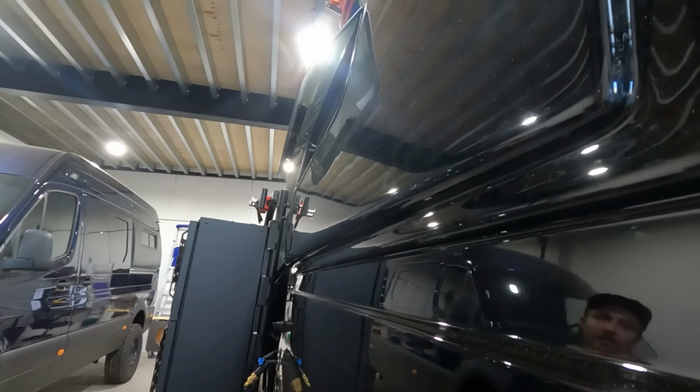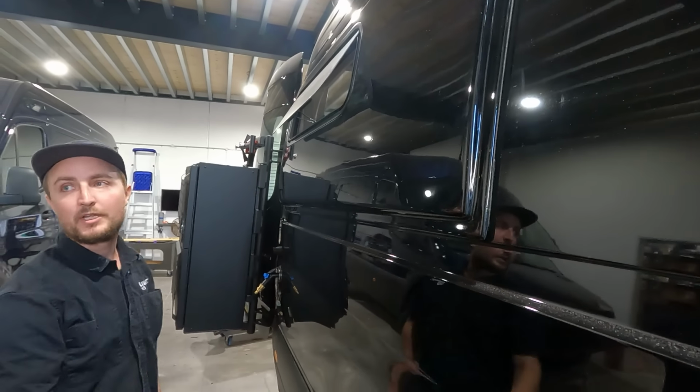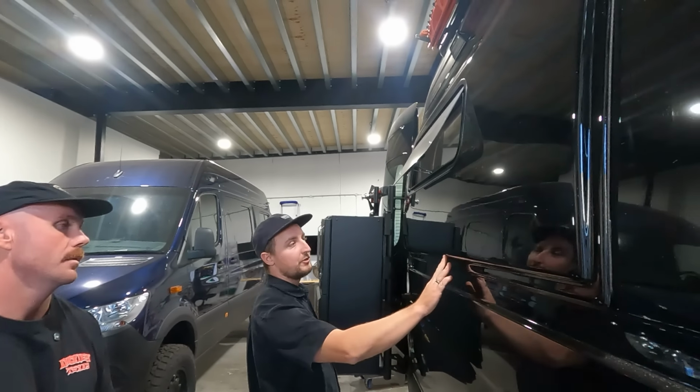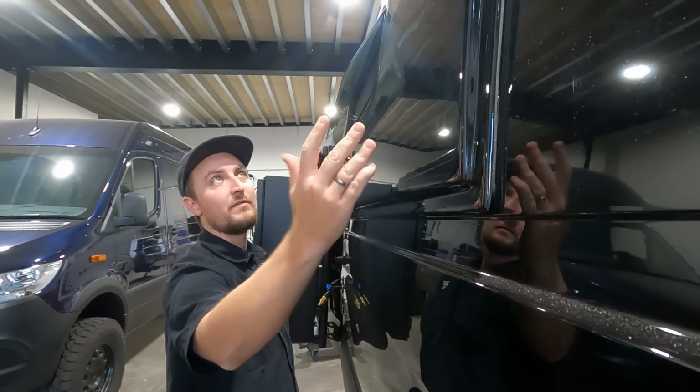It still does have a taper, and then we've just done a slight rolled edge on that front edge just to give it a bit of flow. So pretty much the same profile, but just pushed out literally by... we've taken the mould, we've chopped it through here, we've added 50mm, and then we just reshaped that front edge.